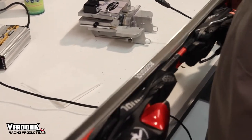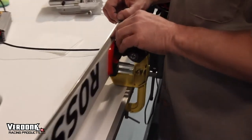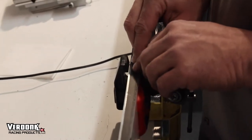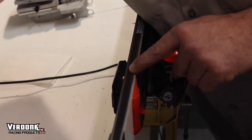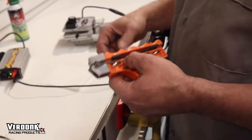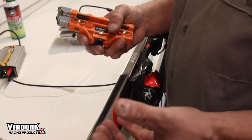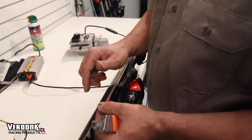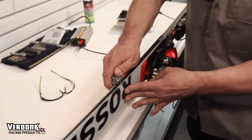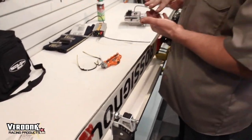Before you start anything on your side edge, you're going to want to make sure that you get rid of what we call the bumper on the ski. That's just that little lip right up on the side of the side wall — it's not the full side wall, which most people think. That bumper has an aluminum layer on the bumper side. I prefer an SKS tool, but you can use any type of side wall tool to do this job. You just want to pull back the bumper. Just like tuning by hand with a file, if you have that hard side wall material and the aluminum there, your file won't cut. That's why a lot of edge angles are actually incorrect — even though you think you're using a three-degree file guide, it will roll up on that material. The SKS tool simply goes in and pulls away that side wall up top. It's just the bumper you're concerned about. That just allows the machine to cut as naturally as possible.